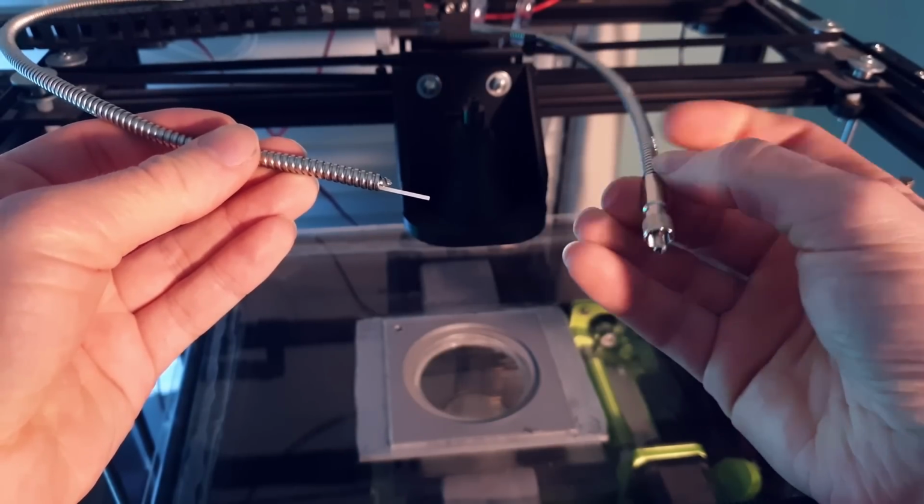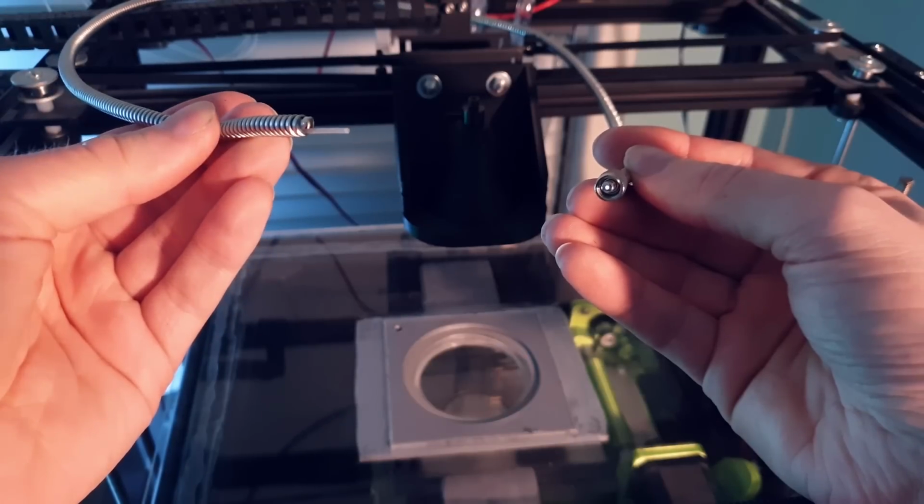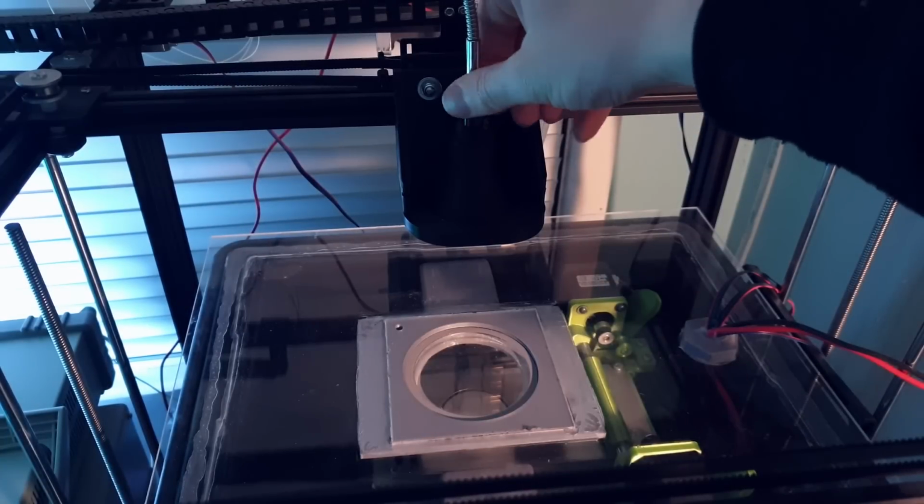So to make life a bit easier, I happened to have a broken fiber on hand, and I would simply inject light into it so I could see whether the lens is actually in focus. Now, I'm just using the LED off an old cell phone and injecting that light into the fiber. Since the fiber is 800 micrometers, and given that we have a back focal length of 26mm and a forward focal length of 40mm, I was expecting the focused spot to be about 1.3 millimeters.